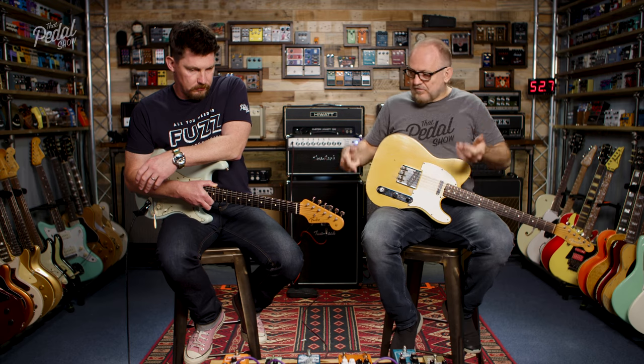Yes, it does have a crazy output buffer, but I think more likely is that the output impedance of the Secret Machine is so high that it's struggling to even drive the patch cables up to the Echo Rec. Therefore, that small jump to the Immortal Echo just goes whoosh. And a lot of the sound of the Secret Machine is that design. So one of the issues of trying to fix this problem is that it changes the sound. Do you fix it here with this pedal? Do you fix it there with that pedal?